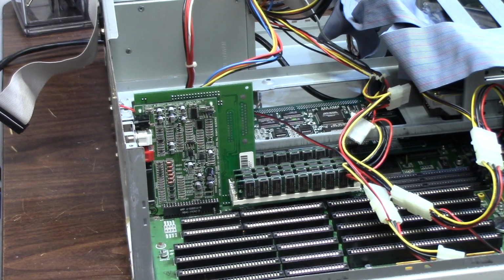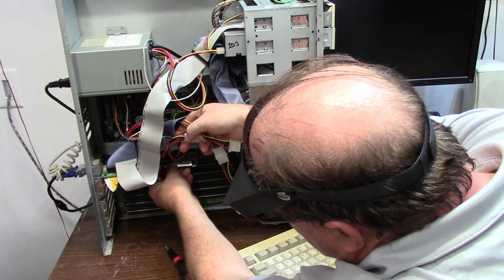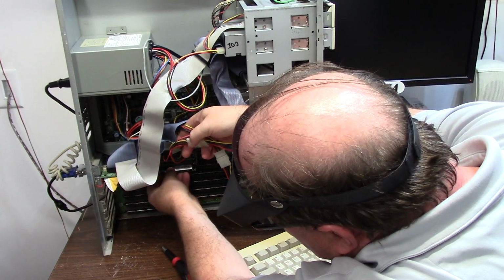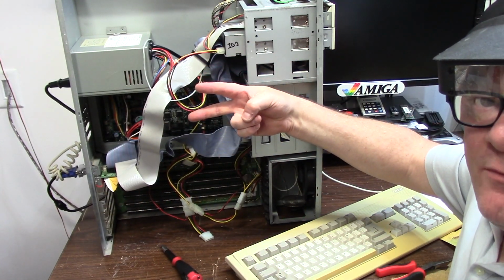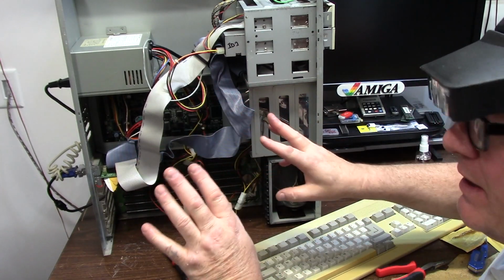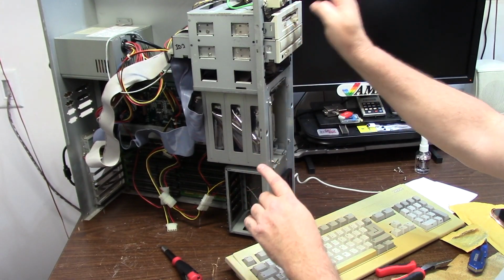Now I'm going to leave these undone for just a second, screw-wise. They have to be put in pairs. I had to set some jumpers, and that allows 16 megs, and then you have the other one to set in pairs for dual-sided, so 16, 16, 16, 16. Weird science. Long story short, this should work, hopefully.